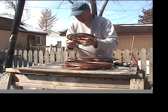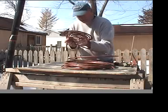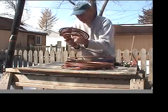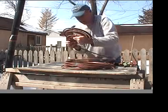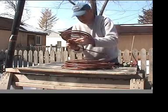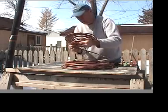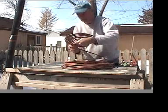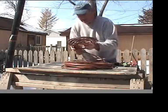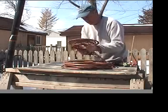You want at least a quarter of an inch gap between each coil for the hot gases to go up. Because we're doing this by hand, they're not perfect, which actually is helpful because it will create a little more turbulent flow of the hot gases on their way up. They're going to hit each coil and bounce around and really bathe each of these coils in hot gases. Those gases are going to start at about 1,000 to 1,200 degrees, and by the time they're done at the top it will be about 350 degrees — so all that heat has been absorbed by this coil.